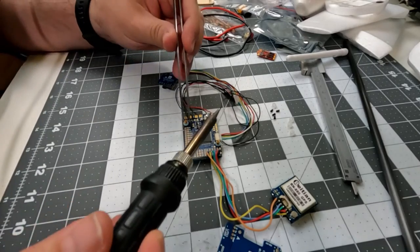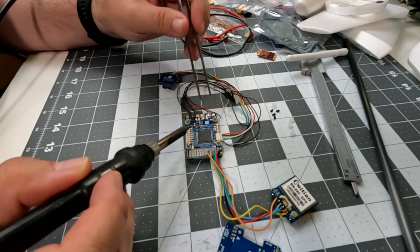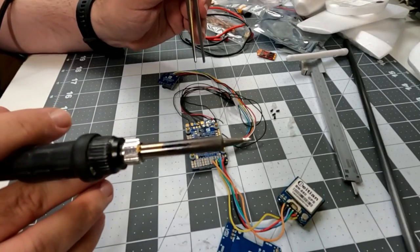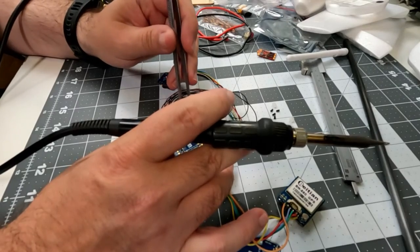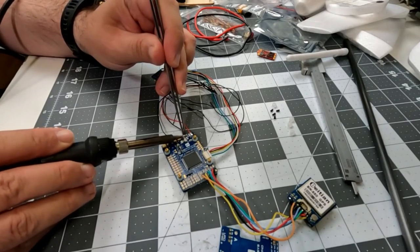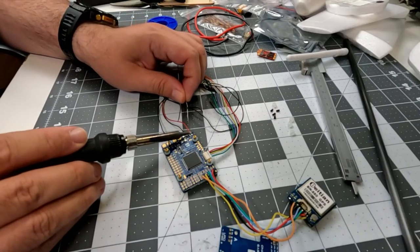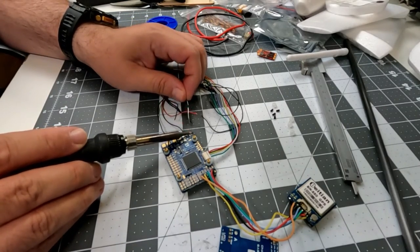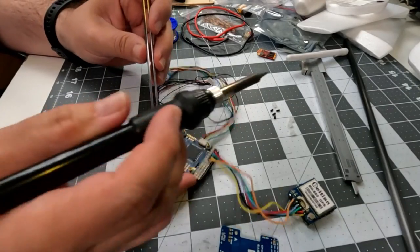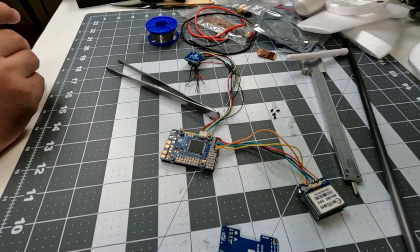And let's start soldering. By the way, if anybody asks what's the best temperature for the soldering iron, my short answer is that this is 350 degrees Celsius, slightly below 700 Fahrenheit. Yes, many people will say, oh, but this is too much, because the solder, depending where you live, melts at a much lower temperature. Yes, this is correct. But it's not about the temperature, it's about the amount of heat you can get to the solder joint itself. And the smaller the soldering tip, the smaller the heat transfer and heat capacitance of the tip, so it's just better to have something extra.